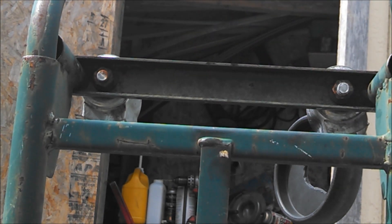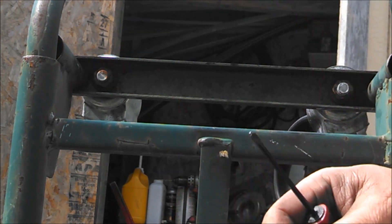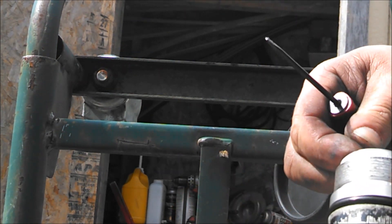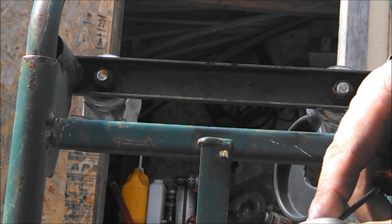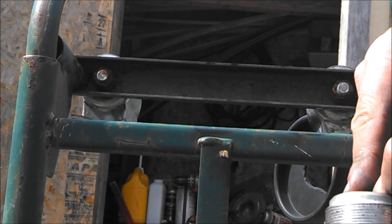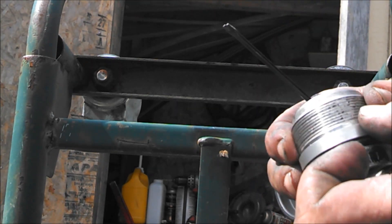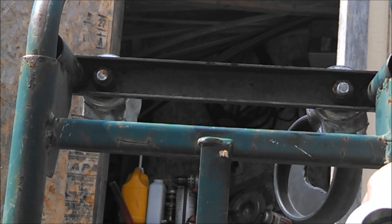So to put it back together, you've got this continuity ring — a little metal clip. That allows the cap to stay grounded to the shaft when the shaft slides through its stroke, and will allow the anode to protect it. That just slides into the middle groove.